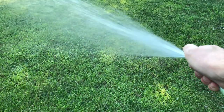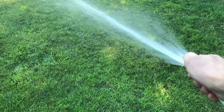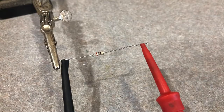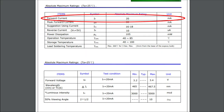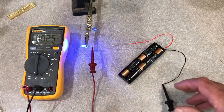Here's how you can work out the resistor values for yourself, so you can hook up any LED with any battery or supply voltage. Thing number three that you really need to know about — current. Electrical current is like the actual water and the amount of it flowing through our hose. Electrical current flows through our LED, only it's invisible unless you measure it. Never let the smoke out — it's hard to put back in. Too much current and the LED will burn out or not last very long. Typically, small LEDs like to have 0.02 amps or 20 milliamps running through them. Check the spec sheet and look for the forward current — 20 milliamps, which is 0.02 amps.